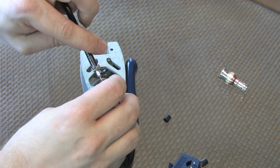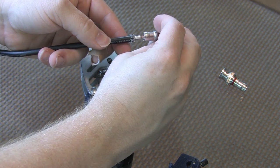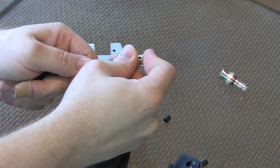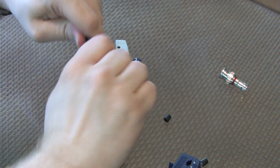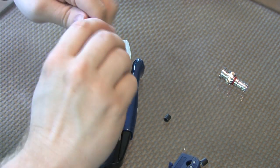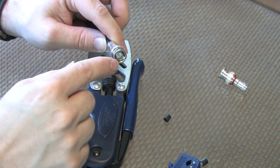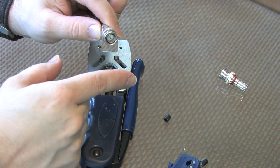You're going to insert your cable carefully into that center pin of the BNC connector and push — it should go on fairly smoothly. You may need to twist and wiggle the cable and the BNC end together. You want to make sure you have it firmly seated and the cable pushed all the way into the connector. If you look at the actual end connection on the BNC, you want to make sure that the pin is flush with the end of the connector.